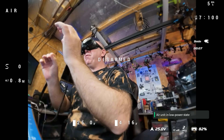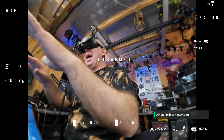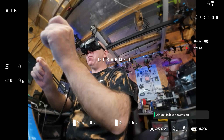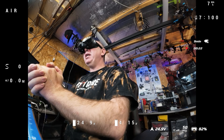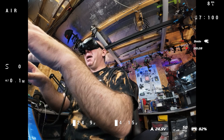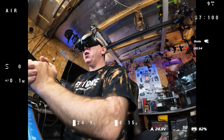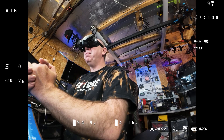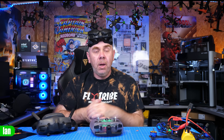Just to demonstrate: I have just reset my goggles. The SD card has been formatted and I'm recording without the HAM file on board. It's important that you don't have it on there when you reboot. We're currently in standby, so if I now arm the aircraft, you will see that it jumps up all the way to the full 50 megabits a second. That is because the HAM file is now not interfering with the RF behavior. Unfortunately though, we are going to be limited to CE power level. By removing the HAM file, you no longer have the additional RF power of FCC mode or the extra channels, but it does give you back proper working functionality.